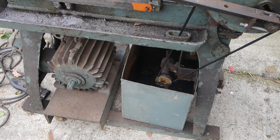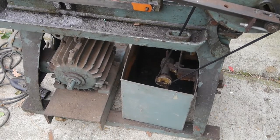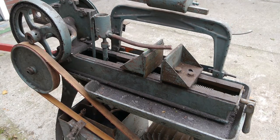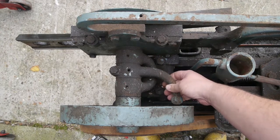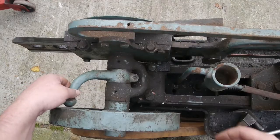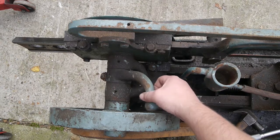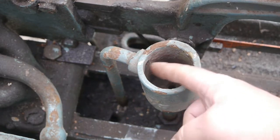They also added some plates on there, probably to compensate for an uneven floor because this thing is not really steady. The leather belt still looks decent enough. There's a handle that I have no idea what it's used for — it might be some kind of brake or lock mechanism. It clamps down with this bolt. I loosened it up but still no idea what it's for. There's an oil hole here that goes all the way to the inner shaft. Coolant is just pumped up into this cup here; the water flows through this tube and overflows back into the tank through this hole.